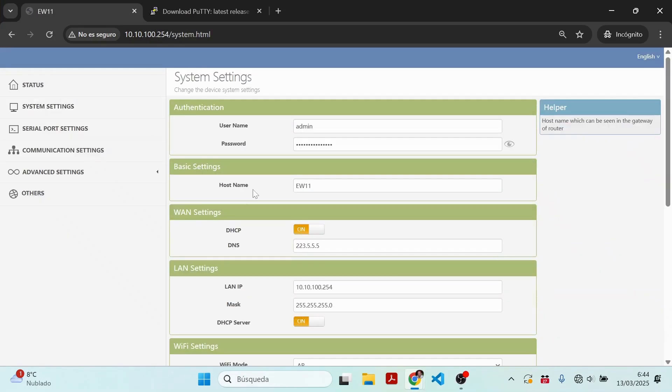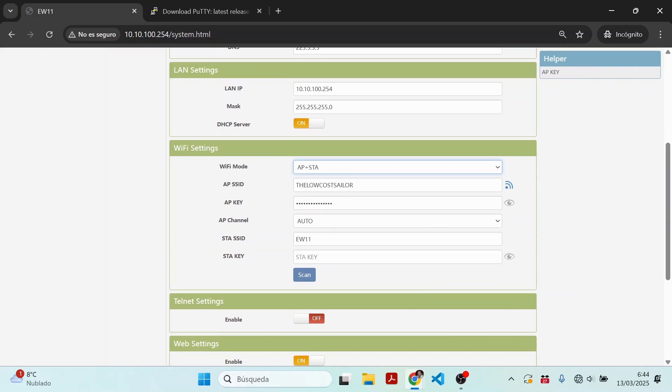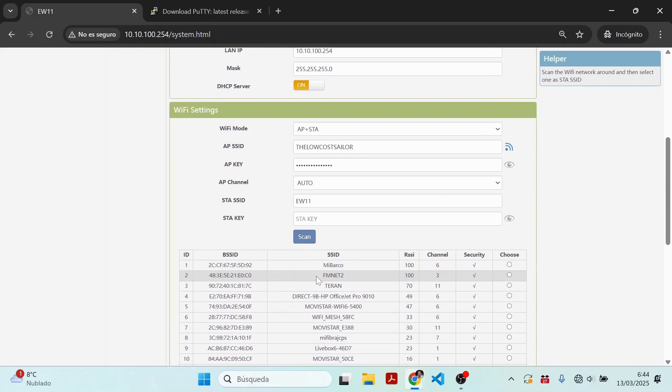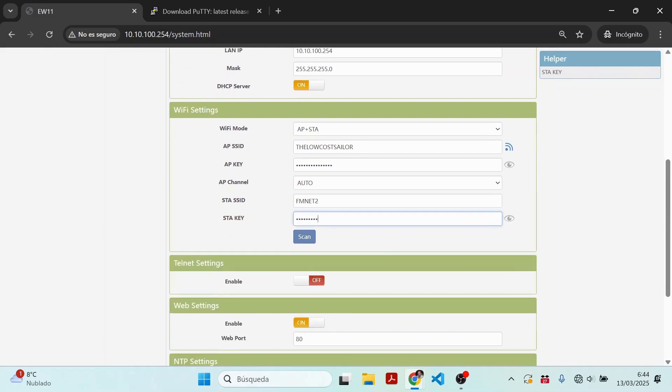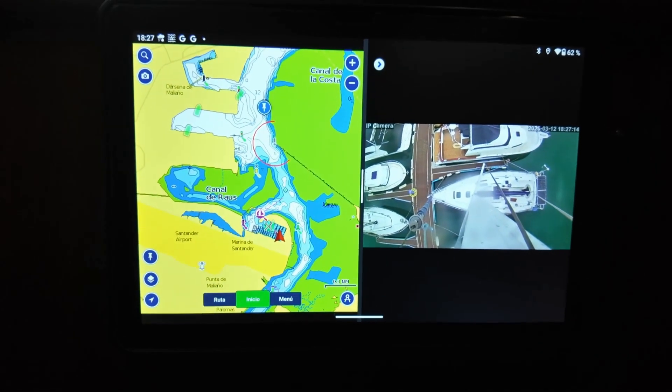You can also integrate the Elfin into your onboard Wi-Fi. In system settings under Wi-Fi settings, choose client mode (STA) to connect to another Wi-Fi network — scan for networks, select yours, enter the password, submit, and restart. This way you can access the AIS data and also the internet through the same Wi-Fi along with cameras and other devices. The Elfin can also be used in the other direction: connect the NMEA input of your autopilot to the NMEA output of the Elfin and configure it as TCP client pointing to your Raspberry's IP and SignalK port, allowing you to feed waypoints and speed data to your pilot without running cables.